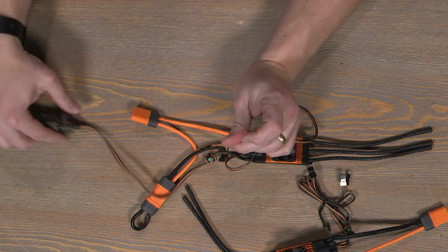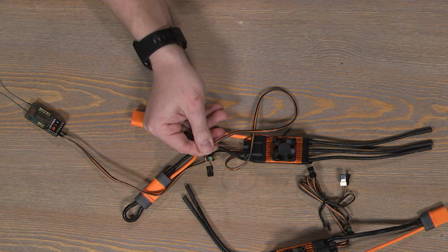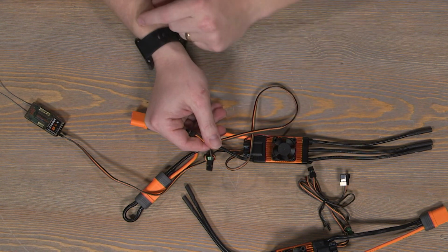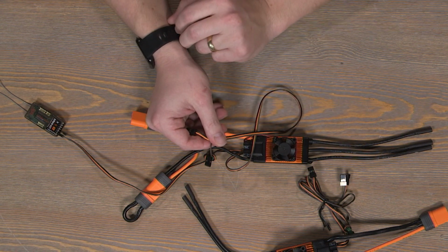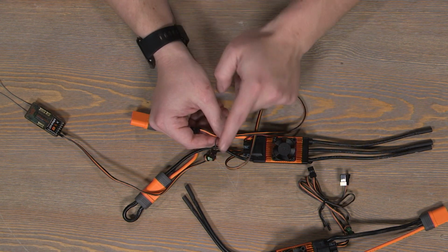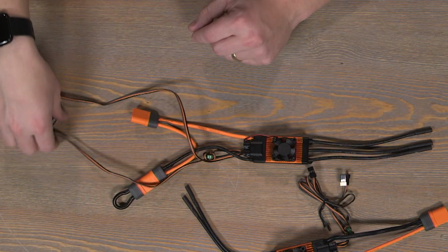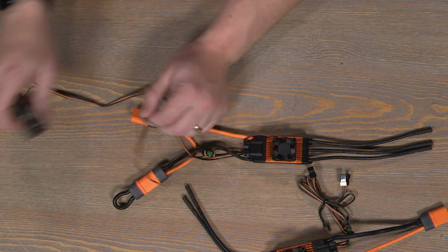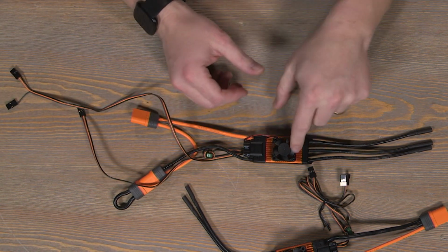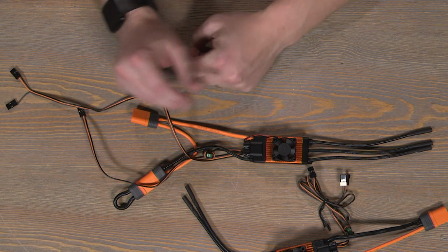And lastly, this little connector here, this little gray one, is simply a tachometer output, or input. So if you're using an external governor on your setup, like if it's a helicopter that needs an external governor off of the main headgear or something like that, you could use that. Some flight controllers you could use that with as well. One cool thing about the Spektrum Avian ESCs is that they have an electronic governor set up inside of them. And if you guys go ahead and watch one of my next videos where we talk about programming the Smart ESCs with the computer setup, you can see how that is set up.